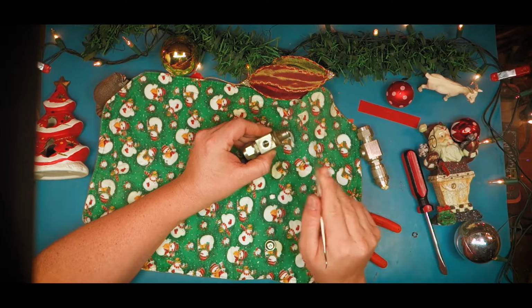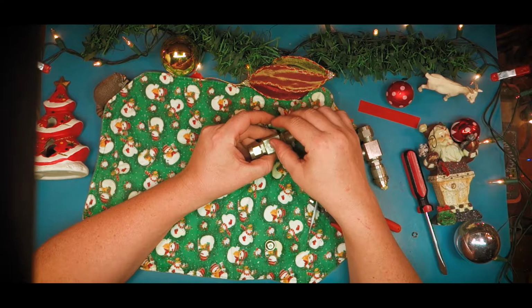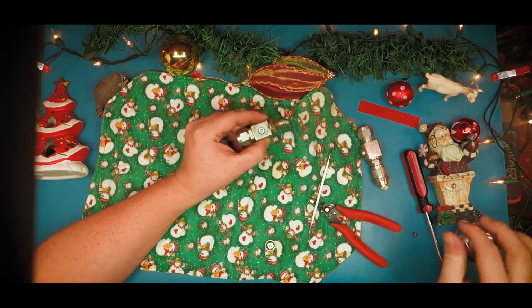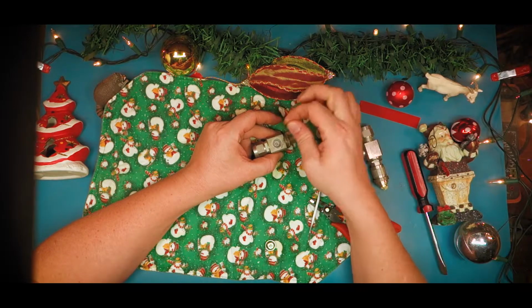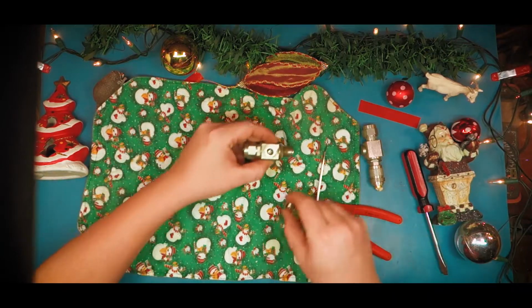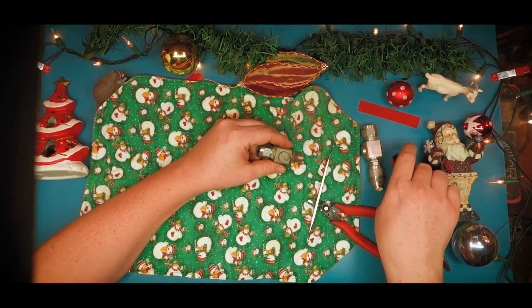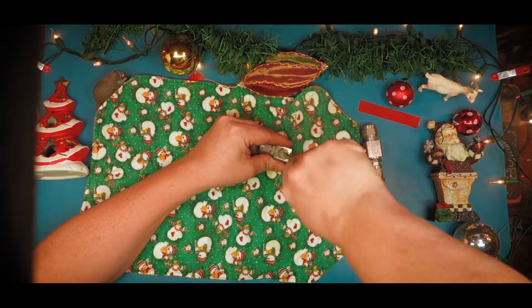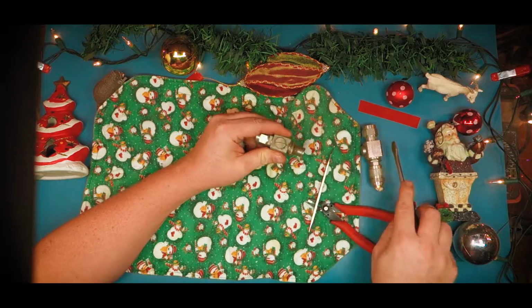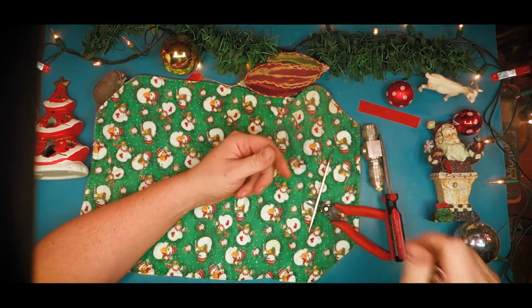So it goes straight across here. But then what happens is when you drop in the GDT like so, this actually rests right on top of that little bridge between the two. And then this little conductive spring goes on top. And then we simply take this little ground piece here and toss it in. And then that will conduct at a certain voltage. It'll fault to ground and conduct the center pole on this guy to the chassis of this.